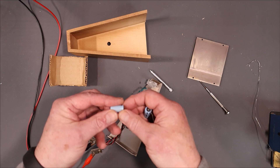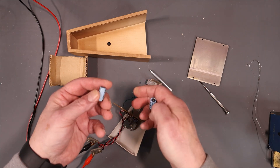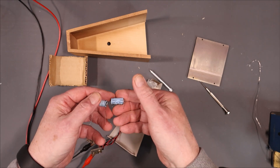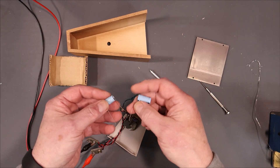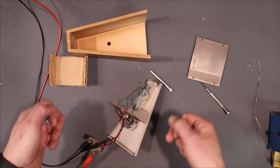I don't have a 25 µF capacitor rated at over 20 volts, but I do have these 47 µF capacitors. If I put two of these in series I should get around 23 µF, which should be close enough for testing purposes. If that fixes it, I'll just order the correct capacitor, but let me tack these on there and see if that gets it working.